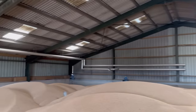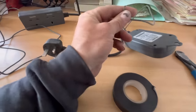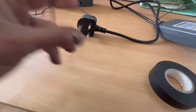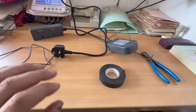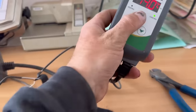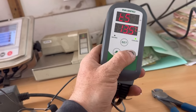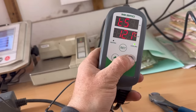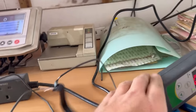Got the back row in now — there's another row here and another row there, that was the hardest one. A few of these have had fans dropped on them and it's chopped the cable for the temperature probe, so I'm just going to join them up. Testing it works — hold down set, it'll say target setting, change that to 12 degrees and set — stop flashing, there we go.